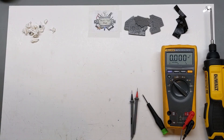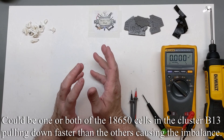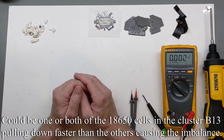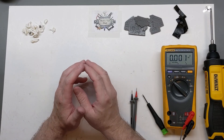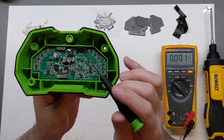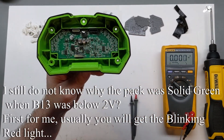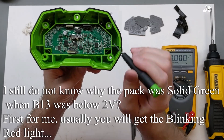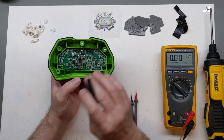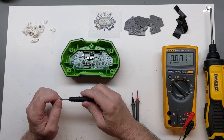So now letting it keep charging. Obviously it could still be a cell issue — I'll monitor that pack and see if that same cell cluster drops down again. It could be something odd that happened, or it could be something with this BMS balancing circuit, balancing circuits 1 through 7 and 8 through 14, pulling the cells down. I'll monitor it and make sure nothing is wrong with the actual BMS board.